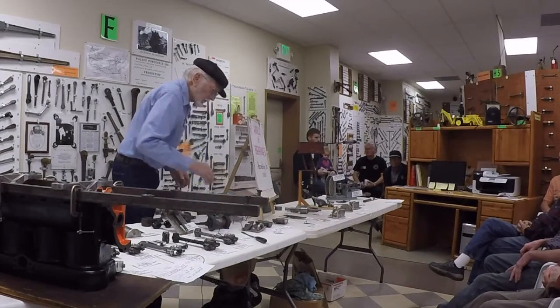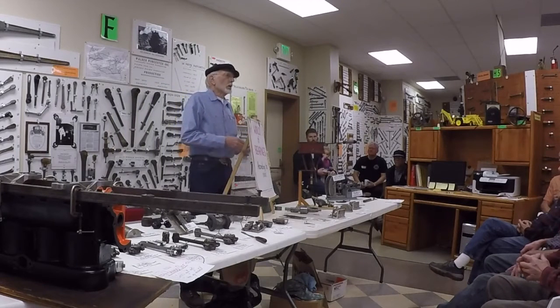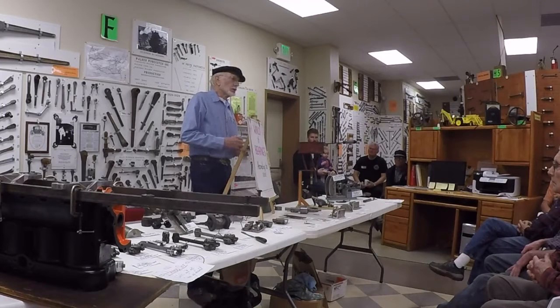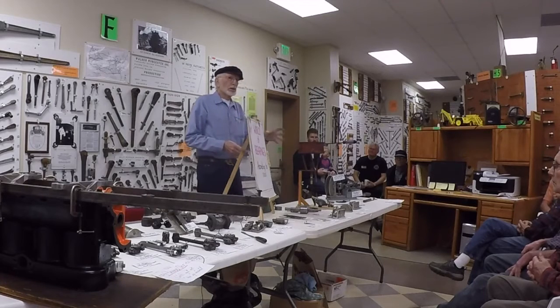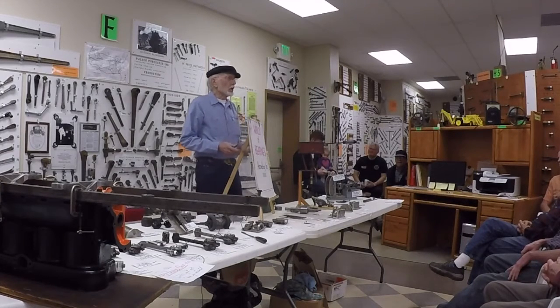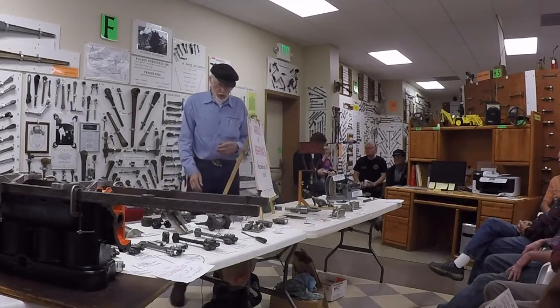So you want to heat it up maybe around 300 degrees. I usually go by touch. When I was doing bearings right and left, I could pick up the hottest damn stuff you could imagine, which didn't go over well with my wife, because I'd be heating some plates up in the oven for supper, and I'd hand her a plate and she'd damn near drop it. I just didn't realize that I could really handle some hot stuff. Not so much now. But you get the pouring fixtures up to about 350.